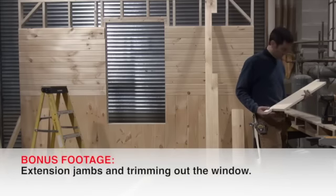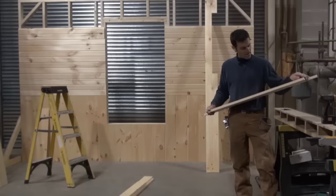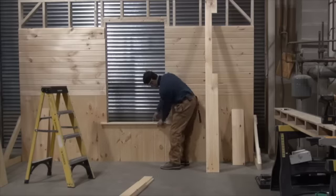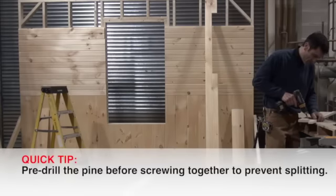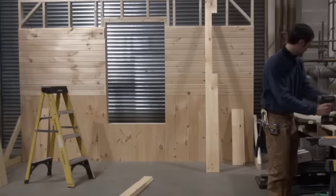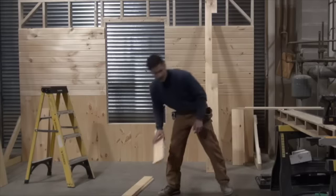I've made the extension jamb pieces for the window, cut out for the wall and the trim. When you figure your width on your window — that measurement from here to there — you have to add your ears so it fits perfect to the wall. Then your side trim can sit on it and you can have a three-quarter reveal all the way around. You have to pre-drill the pine first so it doesn't split — go in about three-eighths from the edge to the center of your hole. You also have to do the sill and the top.